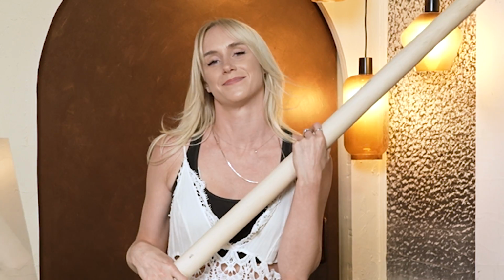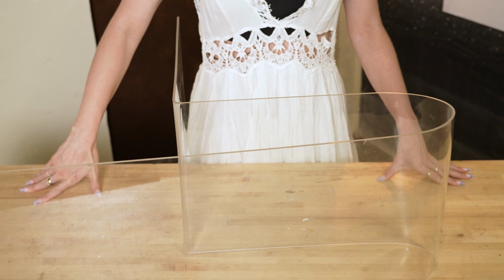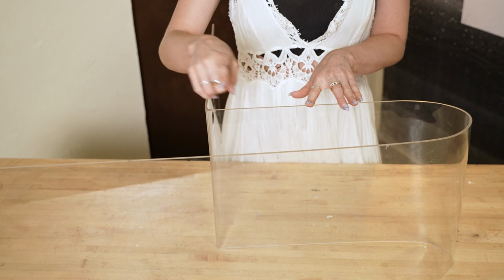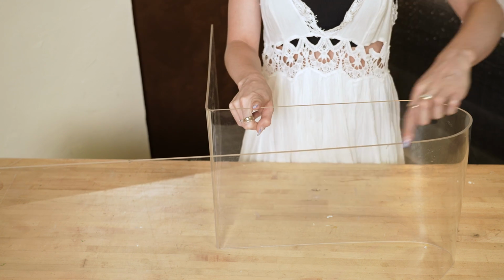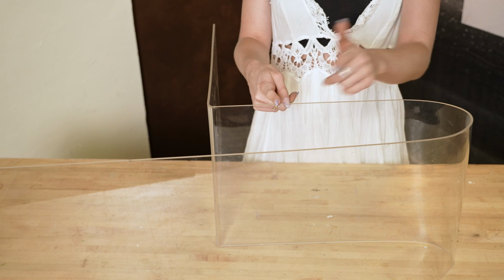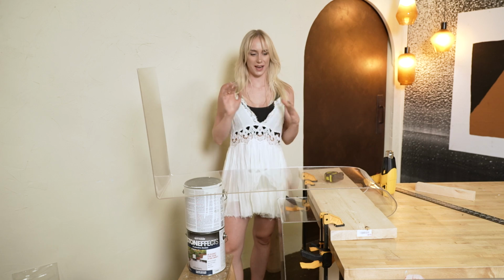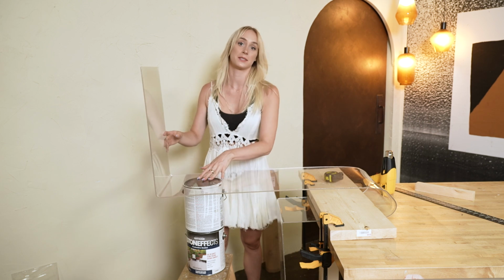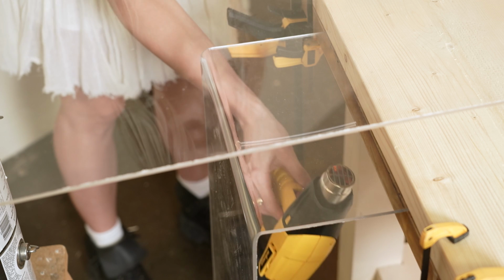So the last step to finish off our console table is going to be adding 2 more right angles about here and here. You want them symmetrical on each side of the little dip that you've made. I'm probably going to make mine about 10 inches deep so it comfortably fits some magazines. Okay, so I just have our piece supported here on some paint cans, and my plan is to do this next bend and send this leg underneath the table.